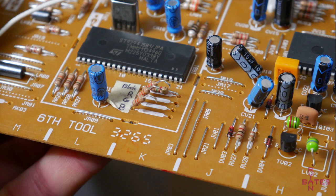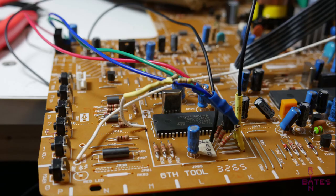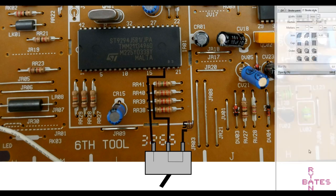I lifted each of the RGB's 3.3K resistors off the board, and where that lift is, is my junction point for injecting the RGB lines. The blanking circuit was a little bit easier to splice into — just lift one side of the resistor near the IC leg. The resistor going to the jungle chip is our common point to the switch. Each pull on the switch goes to either the on-screen display blanking signal, or 5 volts.